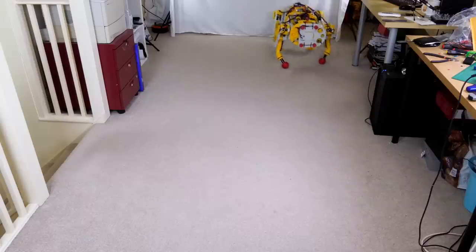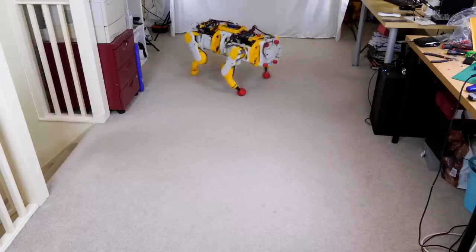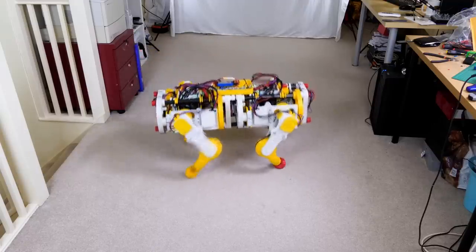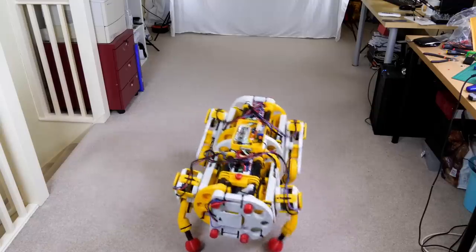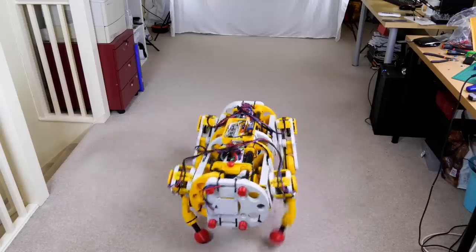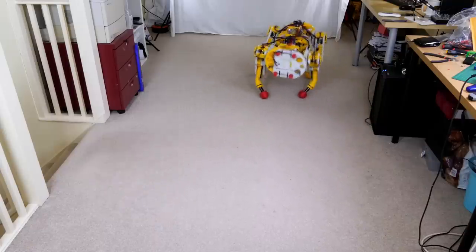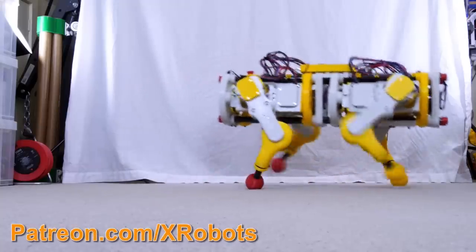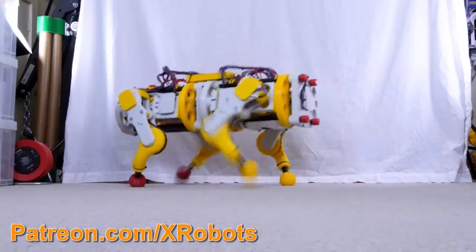My aim was to make something more compact which will give us a better than 5 to 1 belt reduction ratio I'm currently using in Opendog version 2. However we really want something around 10 to 1 reduction so that the drivetrain can be back driven and give us natural spring in the joints to make dynamic robots using the motor driver holding power as a virtual spring. I'm pretty happy with the cycloidal drive I developed although there are a few improvements that could be made which I detailed at the end of the last video.